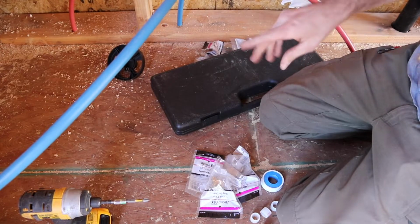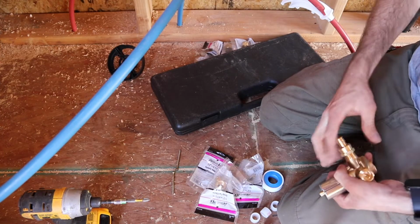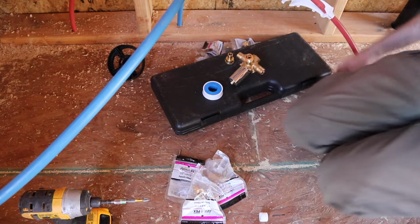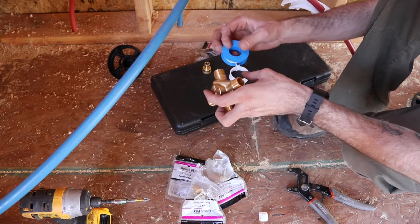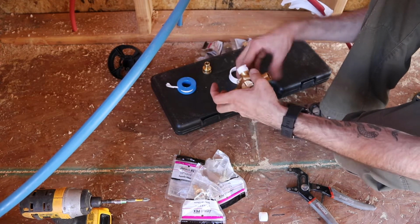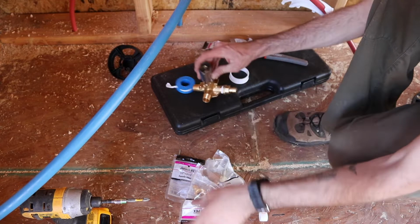To do this downstairs bathroom, we have a bunch of these fittings which fit on there. We'll tighten down, and then PEX will just attach directly to that. Got our PEX sleeves. I got a little Teflon tape I'm going to put on that. And I need to find my channel locks, which are right there. There is a certain way you put on Teflon tape so that it doesn't come off, and that would be with the threads. So we'll just do a couple little things. So there's one. We'll now go ahead and thread this guy on. So let's do that 3 more times.